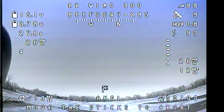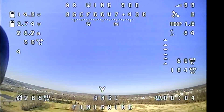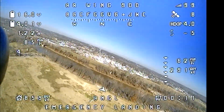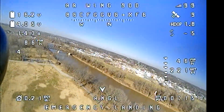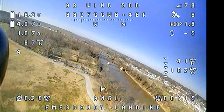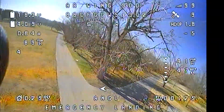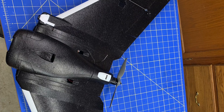In one situation, I launched and everything was fine — I had selected return to home. It gets up to the finishing spot, and then I start losing GPS and it goes into emergency landing. It's either a GPS problem or I messed up the return-to-home abort distance setting. Either way, frustrating — I piled it in but only broke the wing tip, so no big deal.